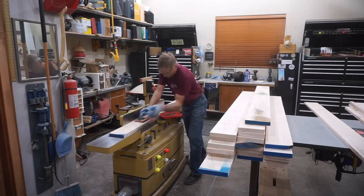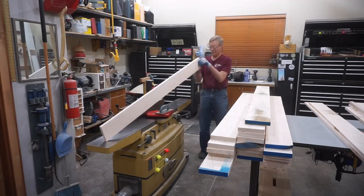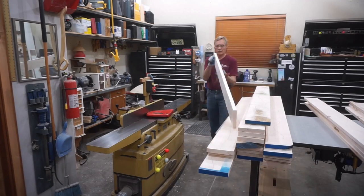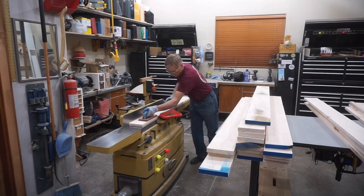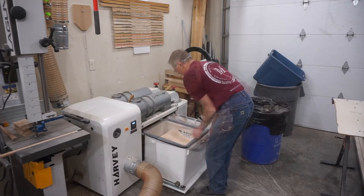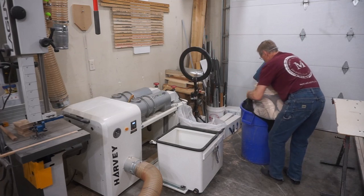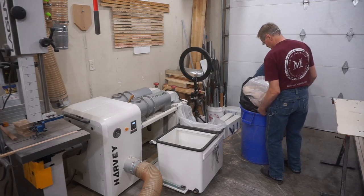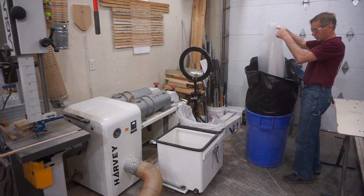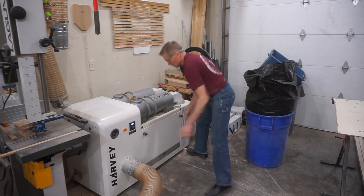Because no two blanks are the same, you'll see me vary my adjustments and the number of passes from board to board so that I get one face clean and flat, removing a minimum of material while ensuring each blank will clean up to exactly 5/8ths of an inch in the thickness planing step next. This systematic process of milling rough sawn lumber into blanks of consistent thickness is pretty much routine, and I'm including these clips so you get an overview of the milling process — useful for making your own nickel gap paneling or prepping for different types of moldings like casing, base, or even crown molding. Because of the excessive amount of material being removed, I frequently check and empty the bins in the dust processor to optimize dust collection and prevent the automatic shutdown cycle if the bins overfill.